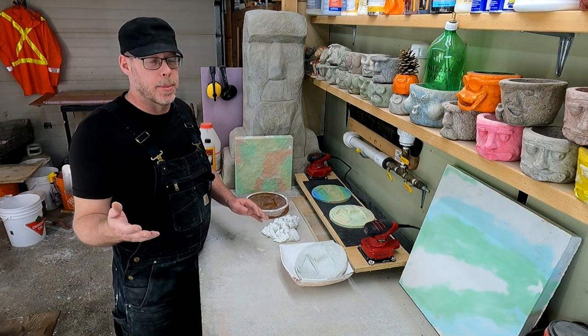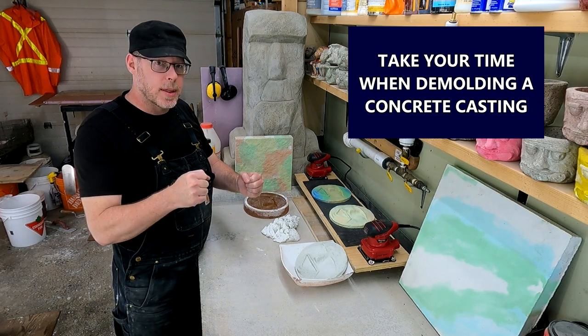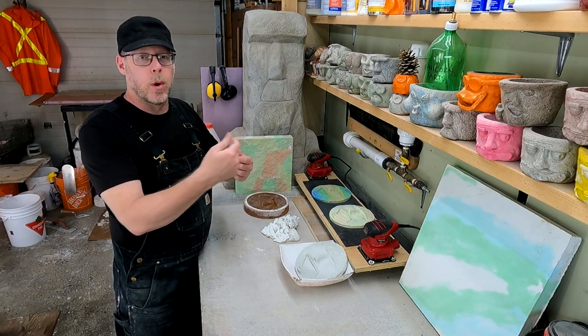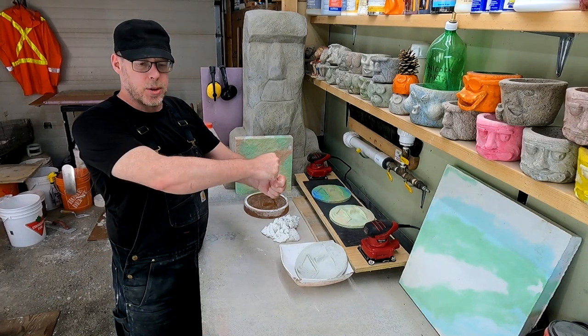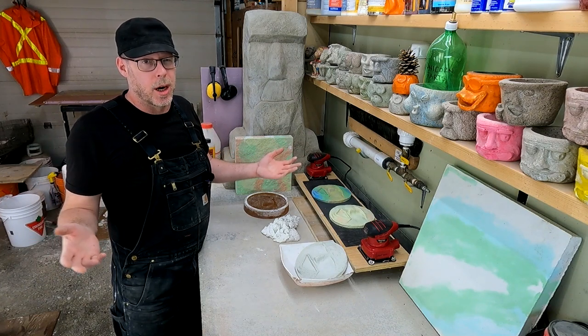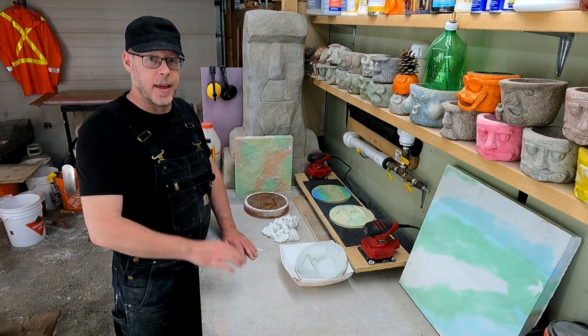Since I mentioned the demolding process — take your time. Don't rush it. Don't force the concrete or you're probably going to break it. Take your time bit by bit, work the edges all the way around, and keep doing more and more passes until you can successfully demold it. If you just grab one and tear it off, it might work, but more likely than not you're going to break what you're casting. Patience is key.